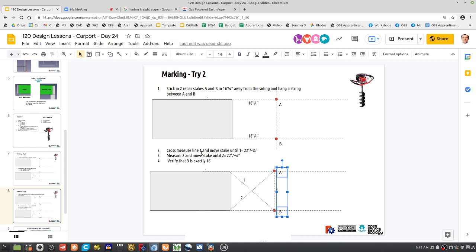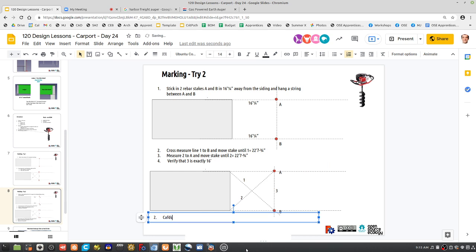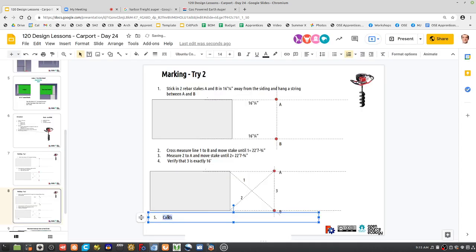Like the actual position of the hole will be 3.5 inches away. Yeah, so then step five. So let's do that. Measure, put in a stake. Put a pebble there, put in a stake until you're just exactly ready to auger.